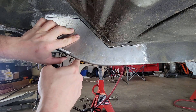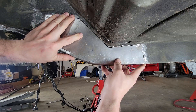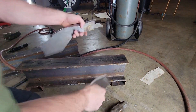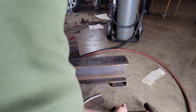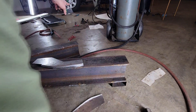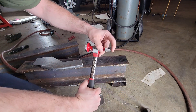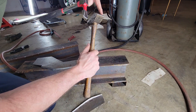I had my basic radius that I wanted to put in the piece, but when I started — I'm not even going to lie — this was like a quarter inch too long. There are no special tools I used. I literally just used a hammer, a piece of angle iron, and I did have my body hammer. That's about the only specialized piece of equipment I used, and I used this back wedge edge on both of these a couple of times.